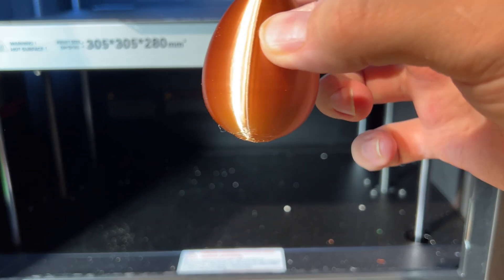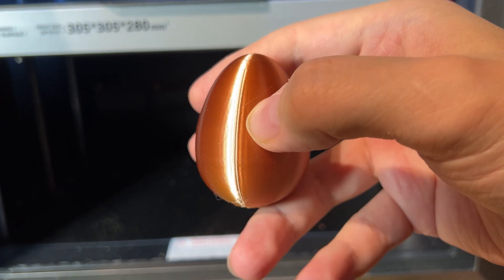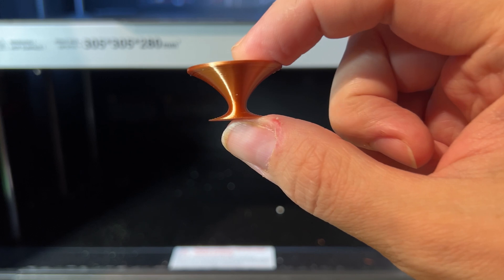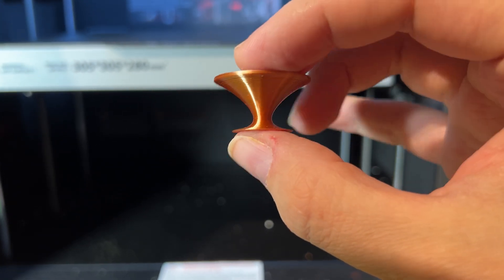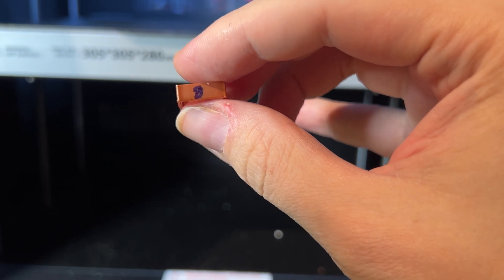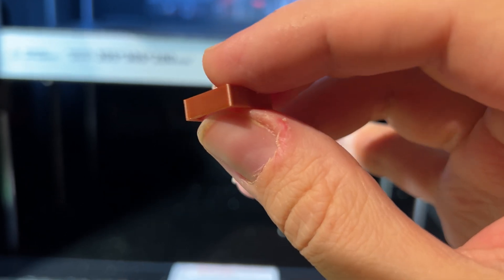Near perfect test prints now — really great quality. This one doesn't have the scarf joint, which is a shame because this is a keeper. And this is one of the test prints with pretty severe overhangs — perfect quality, well over 100% overhang. This was printed at 300 millimeters per second with 15,000 acceleration, and the corners look really good.